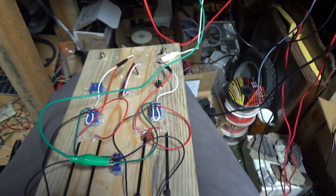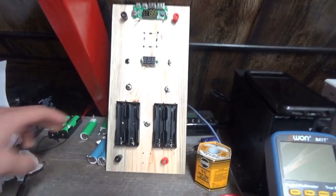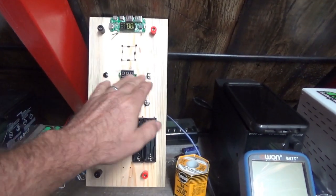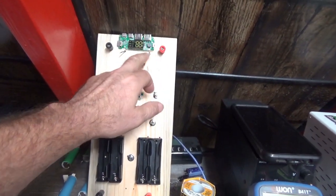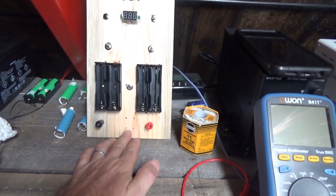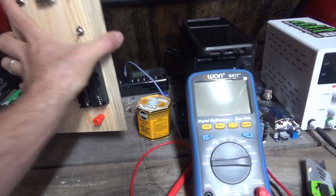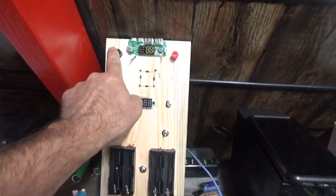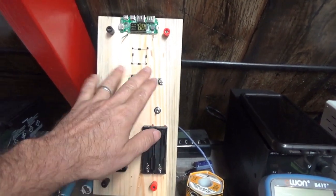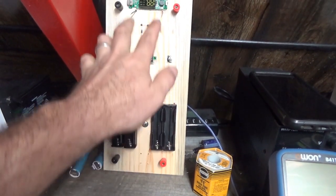I started with one battery, made sure the connections were good, and I had output. Started with the other battery alone, made sure everything was good, and I was getting outputs. Then I put two in — just being careful with safe troubleshooting. I made sure I get series and parallel by flipping a switch. Success! Now I'll do the other test separately, taking these out and making sure these wires are connected right. I've still got to prep some batteries, peel the tabs off, clean them, and pop all the batteries in. I haven't connected the voltmeter, USB output, or solar charge controller yet — just the output connections and diodes are on.